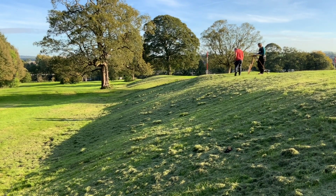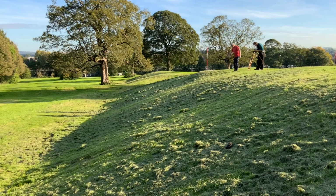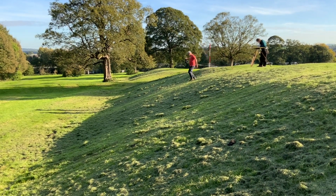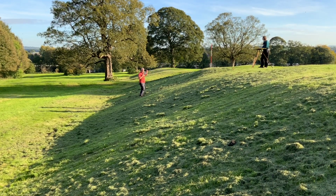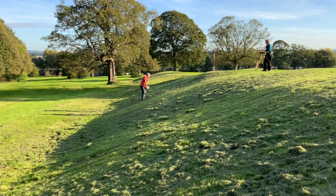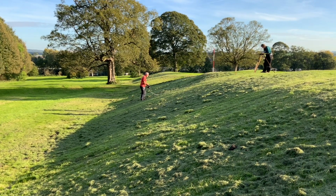On the other hand, rigidly continuing to take offsets every 5 metres when an earthwork is very variable in form, or when it's intersecting with other features, runs a high risk of misrepresenting the changes that do exist. As a general rule, it's helpful to take offsets just before and just after intersections with other features, because those intersections are often where changes in form take place.